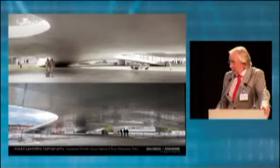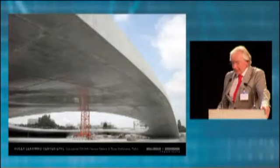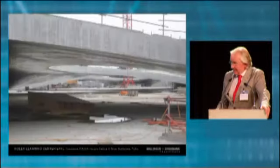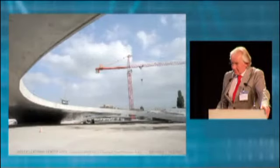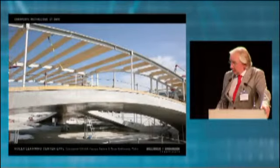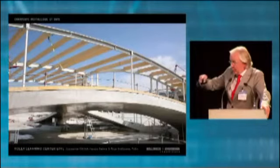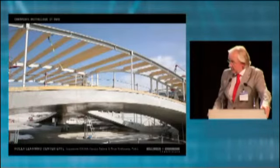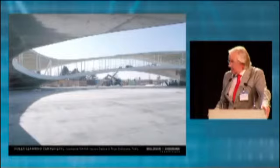I have to say that I'm really happy with the result. As a structural engineer, this is one of the pictures I like most — there are not many structures around in the world with such brilliant aesthetics. The roof consists of main steel beams combined with timber beams. The upper surface of each timber beam was milled down to be parallel to the roof surface, so the corrugated metal sheets could be directly put onto the timber.